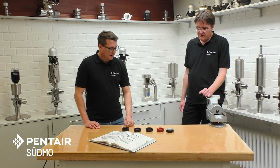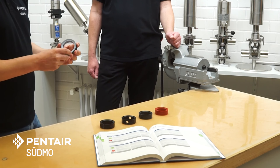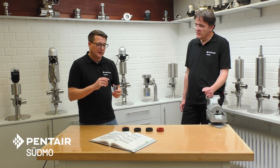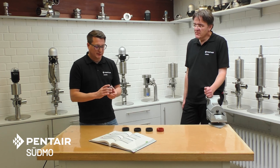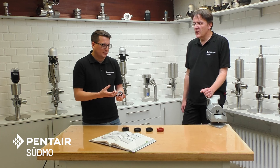The final one is a PTFE-coated butterfly seal in this case. The PTFE itself has extraordinary chemical resistance, but it has some limitations with the temperature used in this kind of seal.